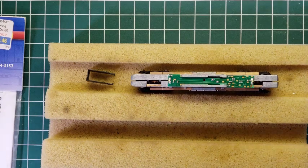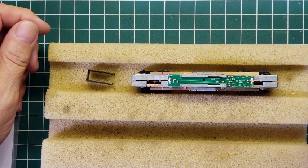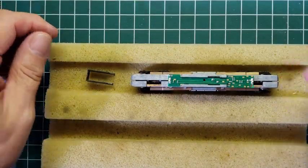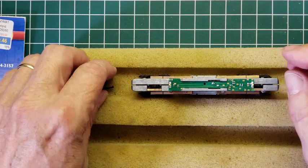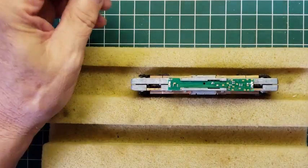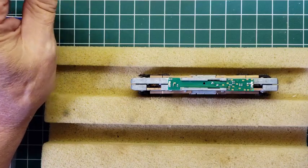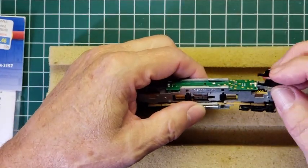And again, I didn't turn it on. I'll turn it on again so you can kind of hear it. But I'll show it to you in the video later. The fan itself is there to suck the rosin, and so the smoke that comes up is what's bad, and it creates some carcinogenic, but also some acidic things in your sinuses. It destroys your sinuses, is the short response here. And because it destroys your sinuses, you kind of want to avoid that.